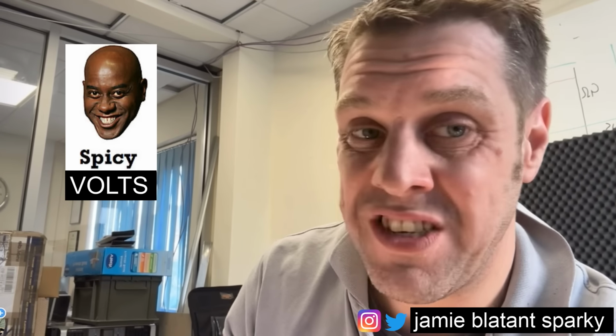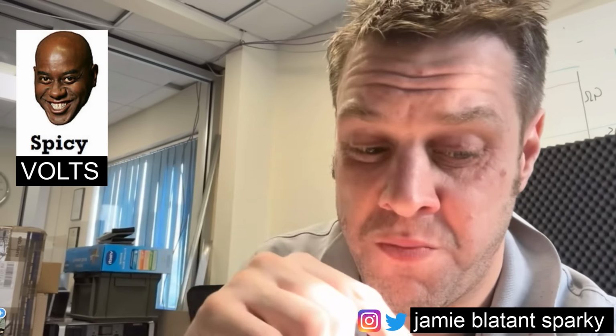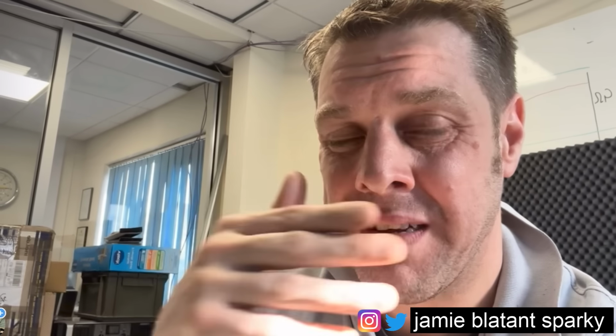So now we're going to get the spicy voltages involved. We've done the end-to-end, and we've recorded that value. We'll keep that value, so that's useful. Now we're going to do an insulation resistance test between each winding and the metal case. Because with the spicy voltage of the 500 volts, if there's a little tiny nick in the insulation, the voltage will get out past that and show you a bad reading, especially on the gigaohm setting.